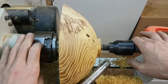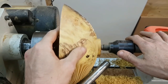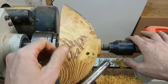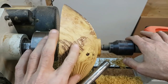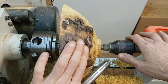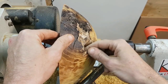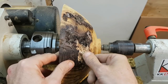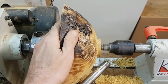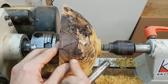This is a mid-turning breakdown of the bowl. As you can see, I've already given it the general shape I would want. Turning off most of the material gave some interesting results — first, there are some points with rot here. I'll have to decide whether to leave the rot inside or pick it out and use some kind of filling. Where the large piece broke, there is a large area of rot that goes all the way into the bowl. I really like this part though — I wasn't aware this piece of wood originally had it, so that's a nice surprise. It's well dry now so I don't expect it to crack any further.